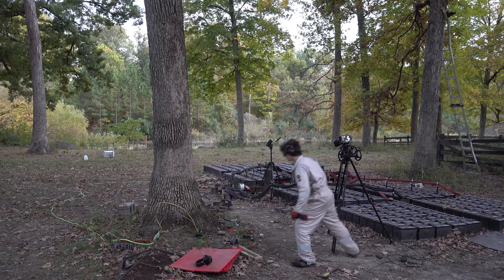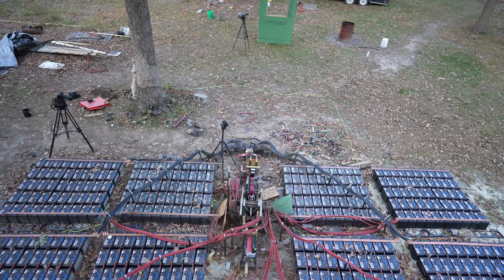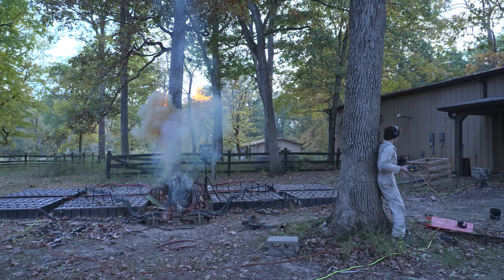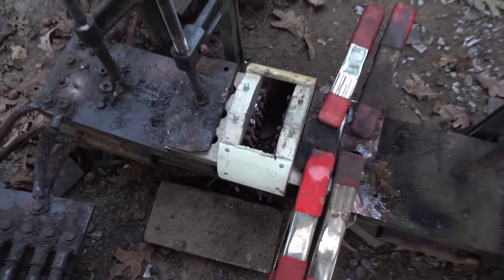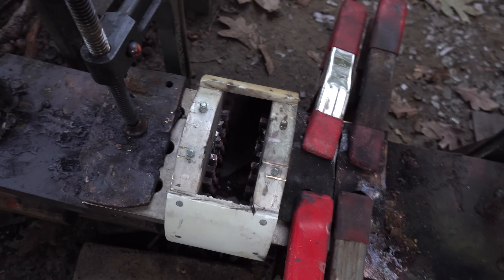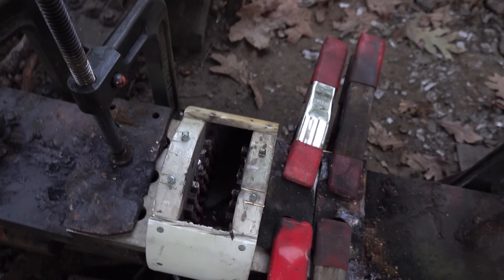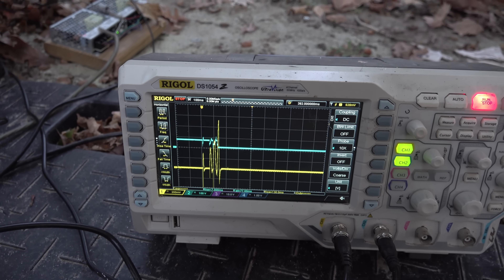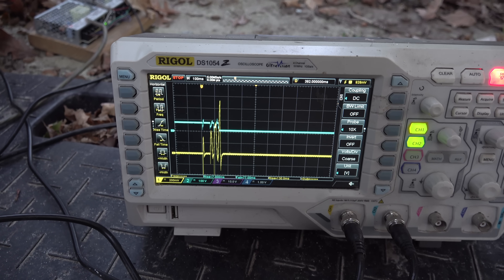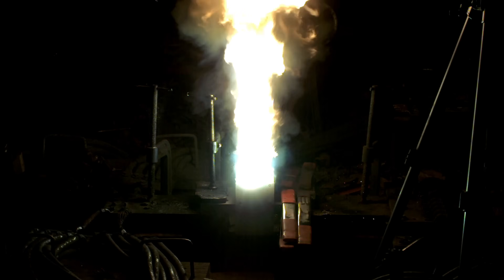Here we go. Okay, yes — that one finally popped it. Thank goodness. I'm surprised how clean of a burn through that was. It just completely vaporized those pieces inside. Kind of surprised just considering the low voltage I'm dealing with. That definitely did it — that was a full pop. The switch had a few hiccups, but once it finally closed, the fuse pulled 150,000 amps, so that is why it was so violent. The slow-mo shows that the fuse made an incredibly violent plasma jet when it burned through. Impressive.